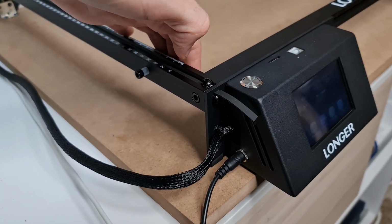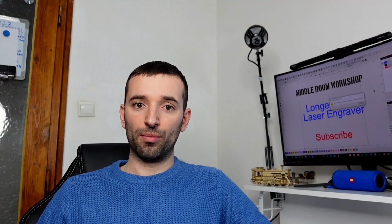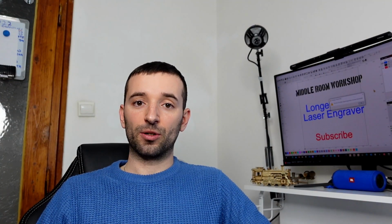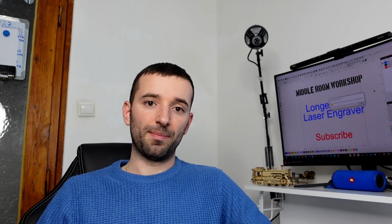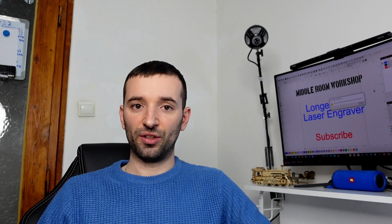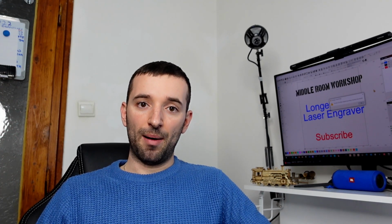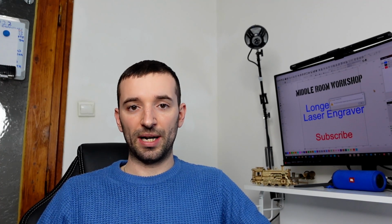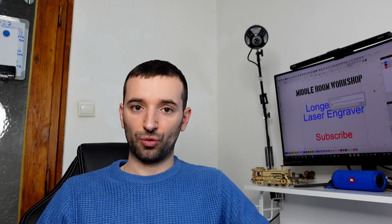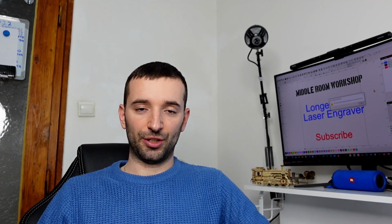The one thing I didn't like though is that the corner where the display is located has no brackets, so that corner is going to be free. And so this is something that you want to keep in mind in case you are going to lift off the machine. I highly recommend you grab a board of plywood or MDF if you need to do so. Otherwise, you will stress the frame and you might even deform it. So pay attention to that.